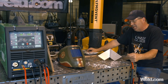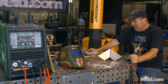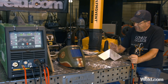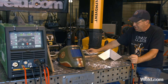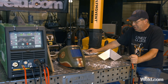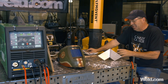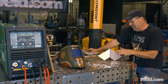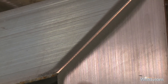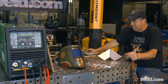I didn't pulse it the first time — all I did was straight up AC TIG and I didn't dress those up. They looked okay. The only thing I did was barely radius this and we bolted them into the concrete just for air. Now I want to do this — I had gouged a little bit in the backside and ran a weld deep, then came out. This one I just barely chamfered a little bit, and I just want to do like a lay wire pulse to see if it'll lay in there and get something acceptable.